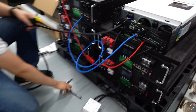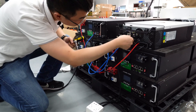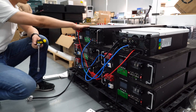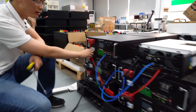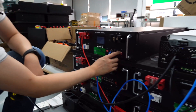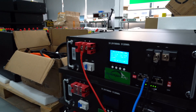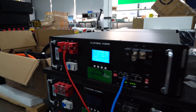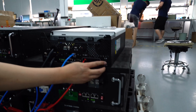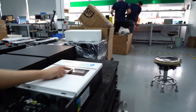Let's check if everything is ready. Now I will start this battery pack — turn on the breaker, turn on this breaker, and turn on this button to start the battery pack. Now it's working. Then we should turn on this inverter — turn this button — and you will see the screen.